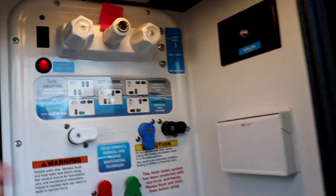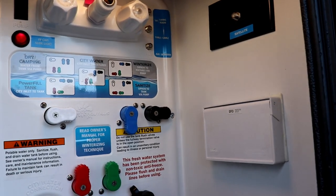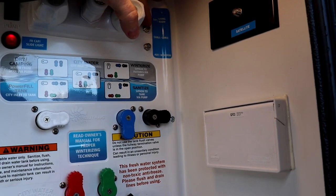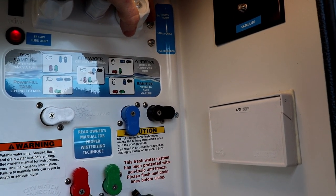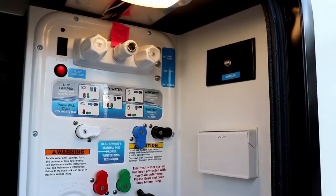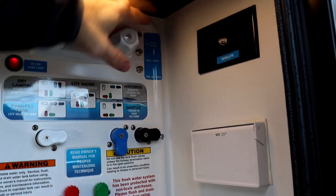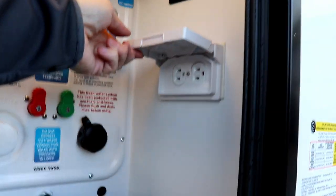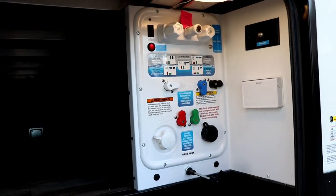In here it can get a little confusing because you see all these connections for what seem like cable and satellite, but it's very simple. You have one connection right here for cable, and that'll go to all the cable connections wherever you'd hook up a TV. All these other ones are for satellite according to what TV you want to utilize — living room TV, bedroom TV — and then this would be the pass-through. You also have a GFI outlet in here, which is nice if you want to put a heater or something else in here.